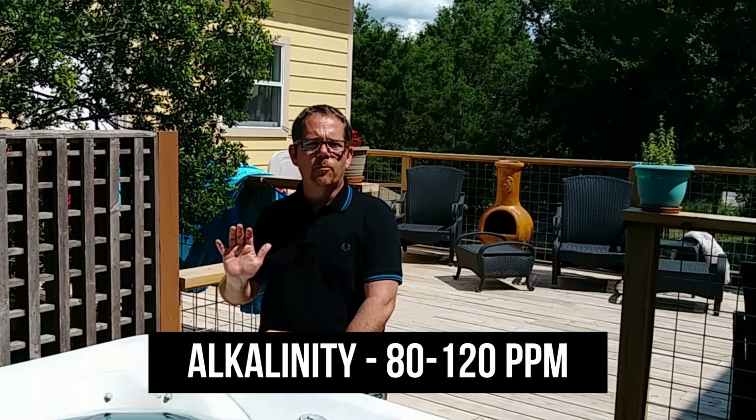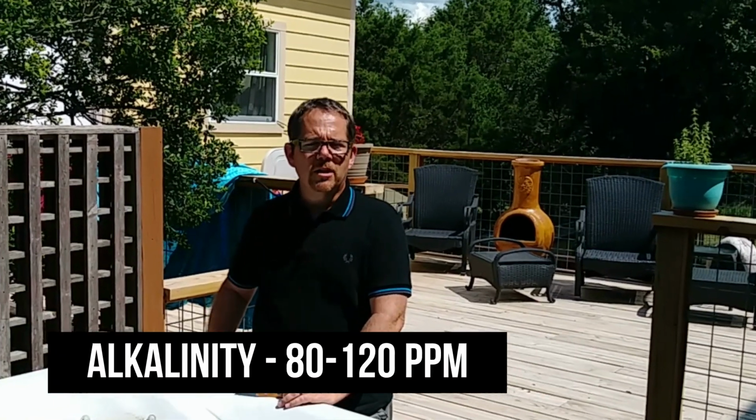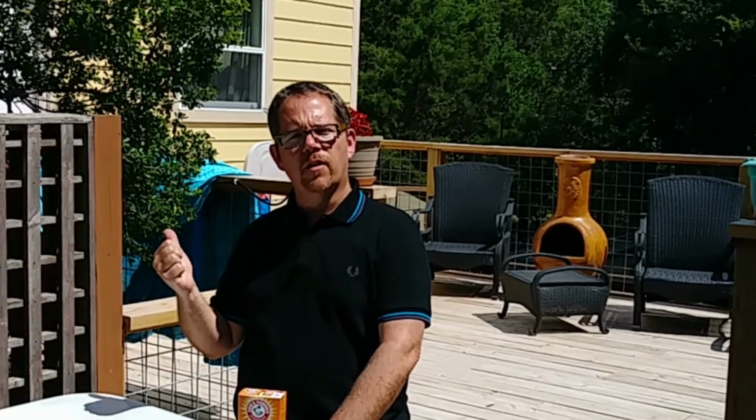So just know that the recommended amount of alkalinity in your hot tub water is somewhere between 80 and 120 parts per million. We're going to talk about some specifics a little bit later in the video, as well as exactly how much baking soda you need to add to get your alkalinity to the right level.